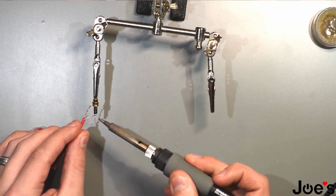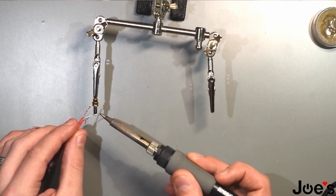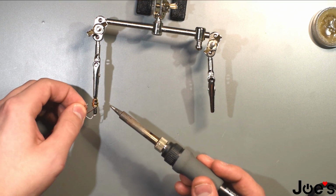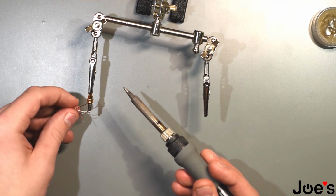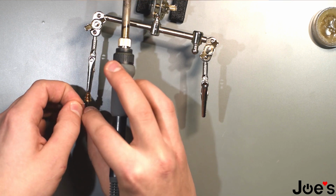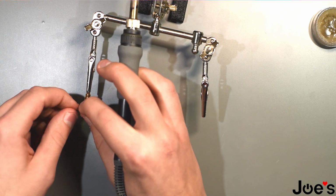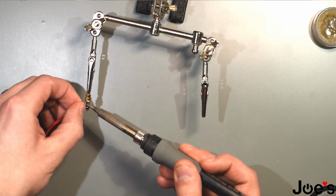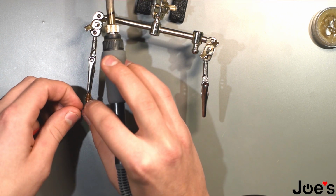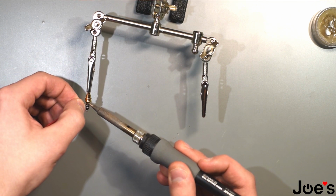Go ahead, put the mic wire, the white wire, first. Then you take the green wire, which is for the right speaker, next. Next one. Then the red wire for the left speaker. Then the red and gold and red and green and gold for ground.